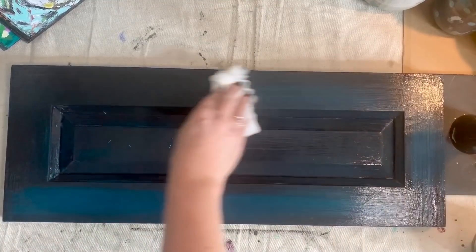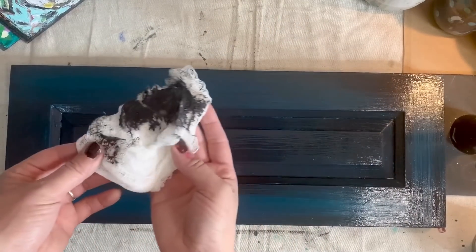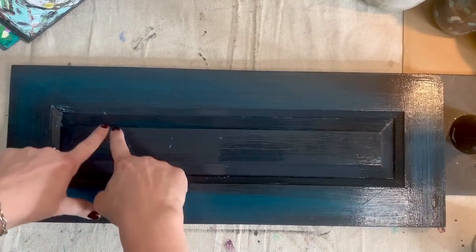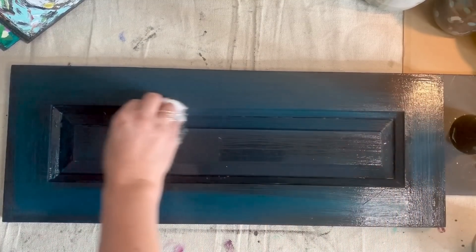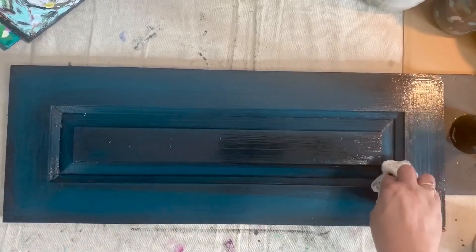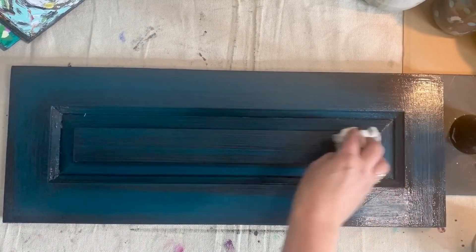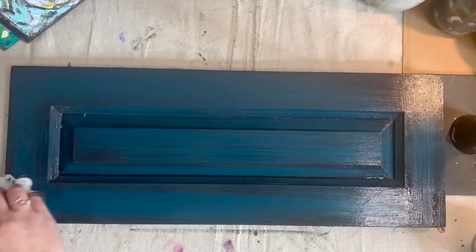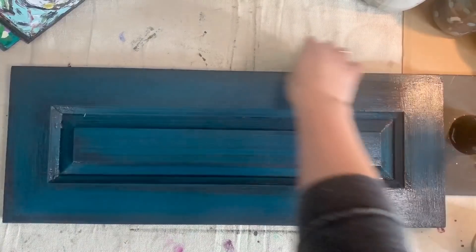You'll also start to notice that you have a heavier touch or a softer touch with your hands. You can fold it over — all of that impacts the amount of glaze that's left behind. The beautiful thing about glaze is that it sets up in the edges. We're not trying to wipe it out of the edges — I'll do a swipe over but I want it to settle down there to get that look, almost like dust has settled in the corners. Let's do a swipe down the middle. I always say if you can find cabinet doors that have those beautiful step-up step-downs in them, they make the most beautiful glazed cabinets. Don't forget your edges as well.